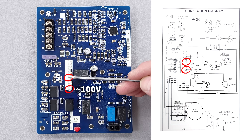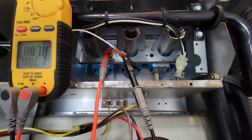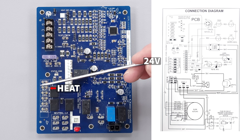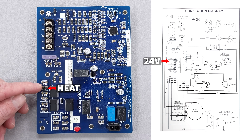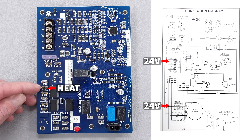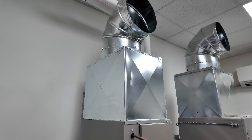On the fifth terminal, you're going to be looking for a DC microamp signal proving that there's a flame - proving that the HSI has ignited the gas coming out of the gas valve. If that does not occur, it's going to turn power off to the gas valve, so it's no longer going to supply 24 volts on terminal 10. If there is a flame, the heat exchanger is going to be heated up. This circuit board is going to wait maybe about 30 seconds before it applies 24-volt power over to the heat terminal, sending 24-volt power over to the fan motor module to turn the blower motor on. It doesn't want to push cold air across the furnace - it wants to wait for the heat exchanger to heat up and then push that 120-degree air out of the supply registers to heat up the building.